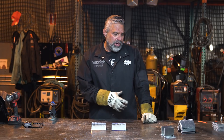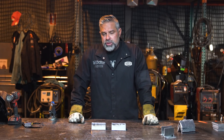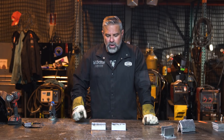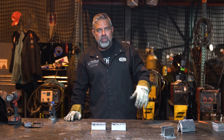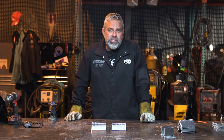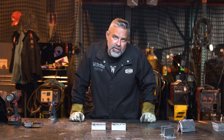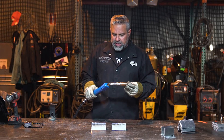Here we've got some test plates. A lot of the welding I did with an aluminum MIG gun involved bull racks — those 40-foot cattle trucks with two layers. They get beat up: kicked doors, cracked hinges, slammed back and forth. They're a mess and full of mess, so you have to clean everything out and make sure your material is clean before you weld it.